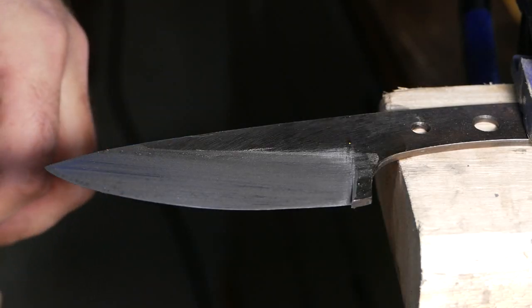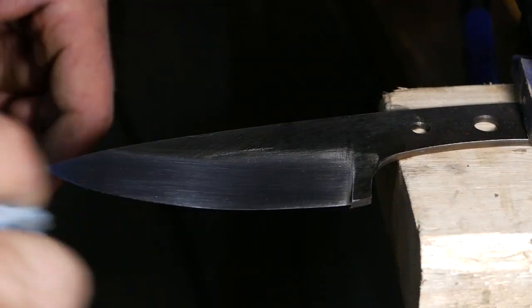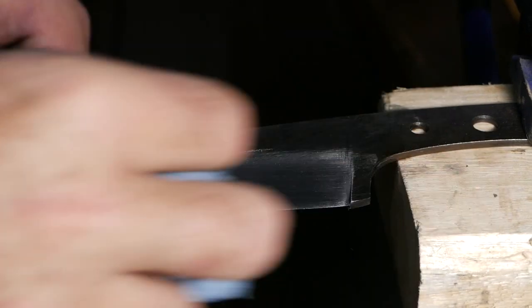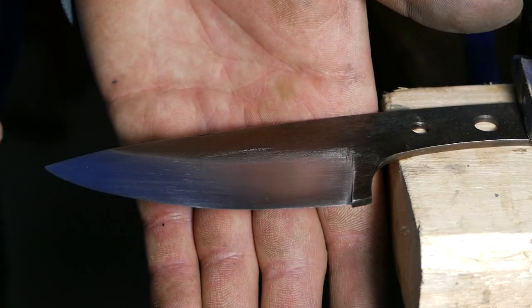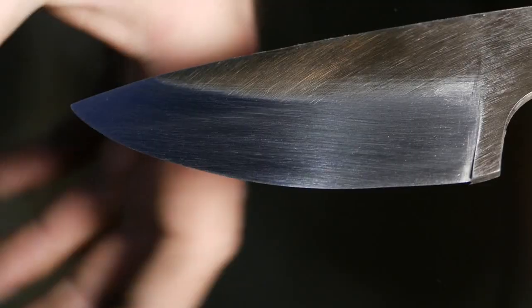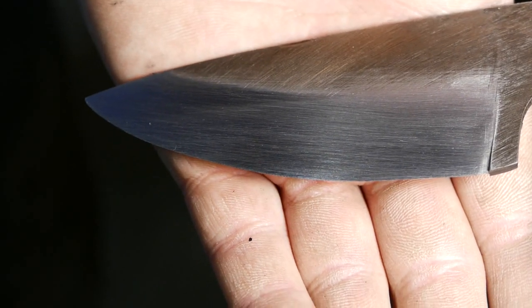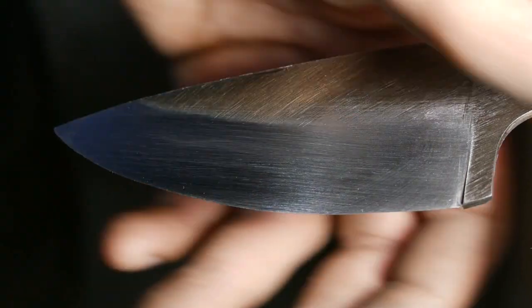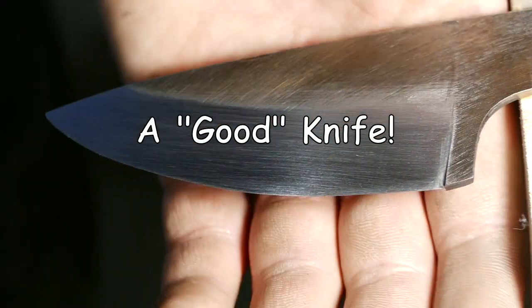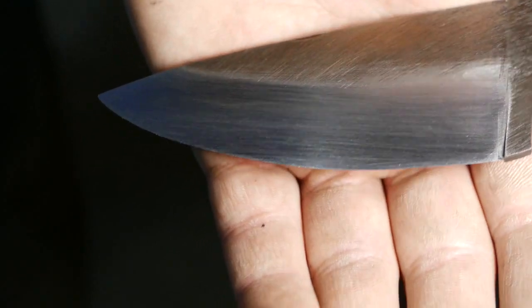Yeah, on my next build, I'm definitely gonna sand before I quench. Sanding hardened steel sucks. I spent nearly 1 hour just sanding with 80 grit. And that's only the first side. So there's a couple more hours of sanding actually. If you wanna make a knife, make sure you have a whole bag of patience, my friend. Let's keep sanding.